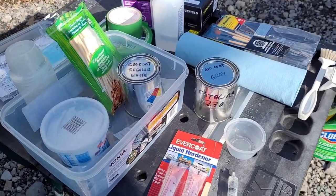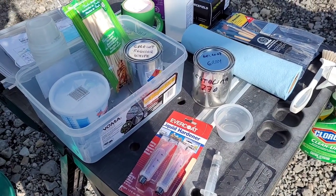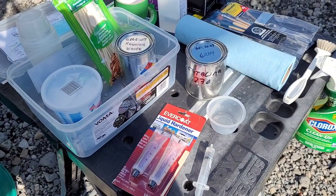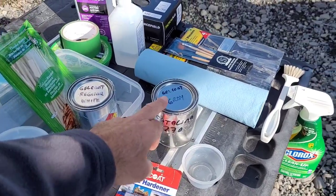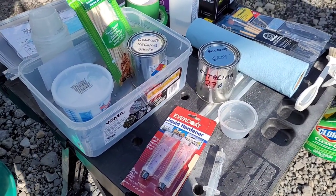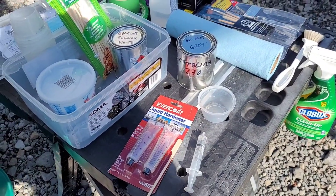To repair the little pinholes on the cockpit floor, I have grey and white gel coat directly from Catalina, but you can get gel coat at any chandlery or boat supply store, or from your local boat repair guy. For the first pinholes, I'm not going to tint them — I'm going to leave them the original grey, a little bit darker, so when they're cured I'll be able to see exactly where my repairs were and check if I need to touch them up again. I will match the color when doing the top coat — with the Interdeck, not gel coat — and I'll show you that later.